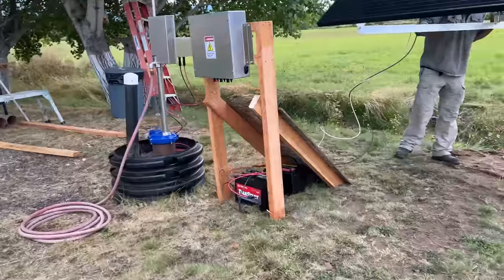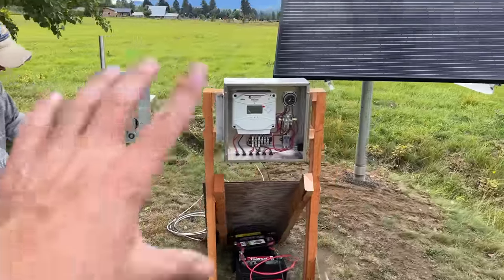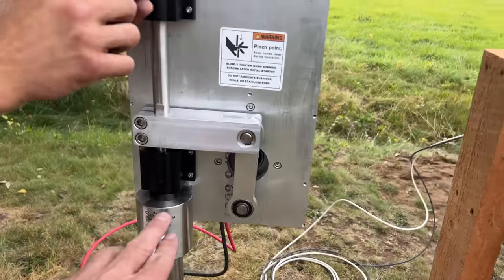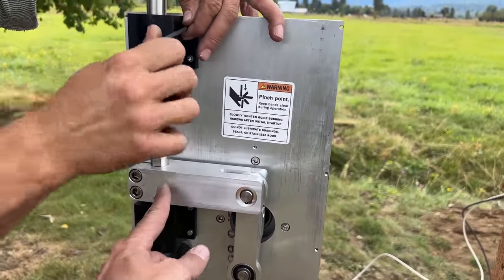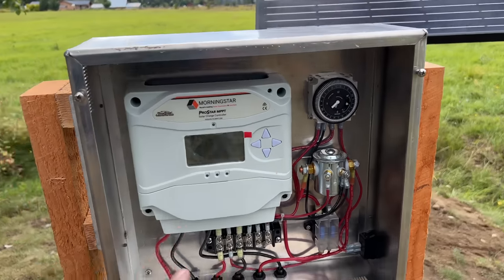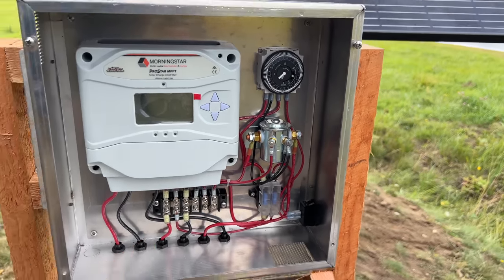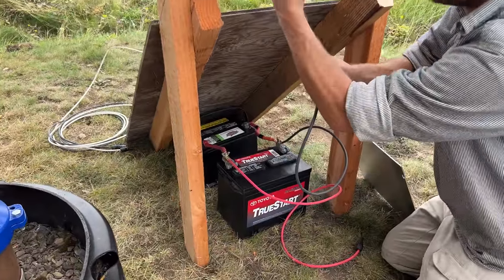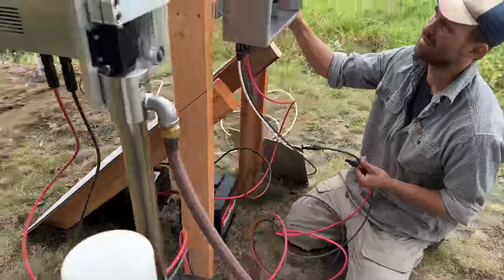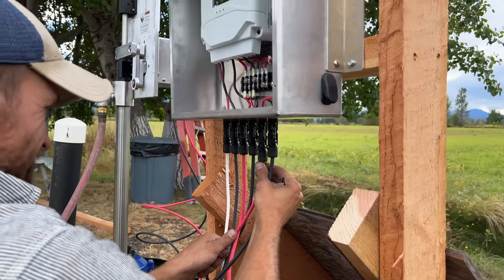Want to see the little electric motor? Gerai, can you pull this cover and we'll show how this works and get this arm adjusted? I want you guys to know you can thank Gerai for this mock-up — he built all this so we could show it to you. So we'll start with the pump. The simple pump — we took off the handle, and this is an attachment that has a motor on it. We've adjusted this lever arm; we haven't run this yet, but I think we've got it adjusted properly. Motor's inside there. This is the charge controller for the solar — you can even set this up on a timer if you have livestock and want to keep something full. There's the relay fuses, very clean. We've got two 12-volt batteries wired in series, so 24 volts. This is our final connection — it's pretty well just plug and play. We didn't have to do any of this wiring; it was all pre-done.